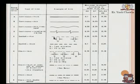Dashed thin lines. These are thin lines which have equal amounts of drawn line and equal amounts of free space between each other. The F is designated as thick line. The same dashed thin line, made thicker and darker, becomes a thick line. Now we have chain thin lines. These thin lines have a larger line, then a space, then a smaller line, then again a space. The space, the small line and the space are of equal distances, whereas the long line is considerably larger than this space and the short line in between. Similarly, we have the chain thick line, the same as that. Now the chain thin double dash line will again show a particular significance in this line.